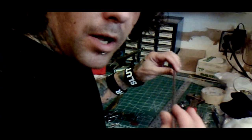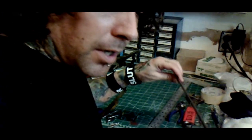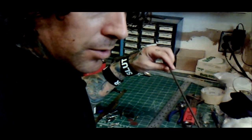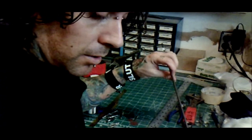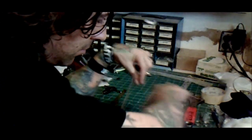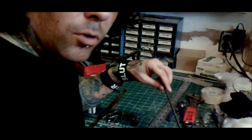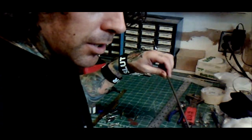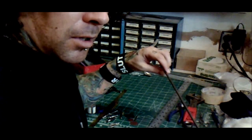First I'm going to take this piece of round steel. This is 3/16 inch regular steel you can get at any hardware store. I'm going to measure off about 2 inches and cut that off because that's what I need for this particular piece. I would highly suggest sketching out your design ahead of time so you know the exact lengths of all the pieces you're going to need before you go into cutting, which I've already done.